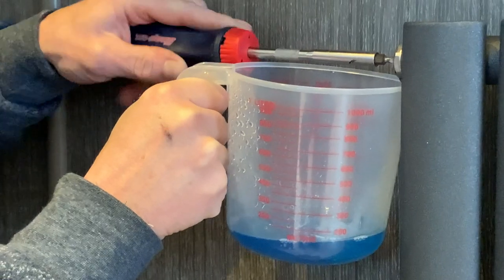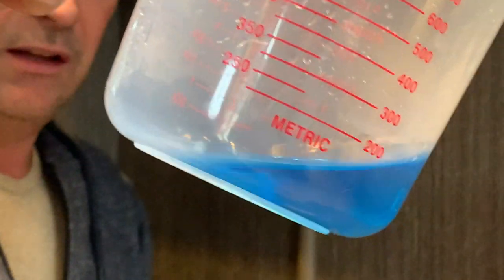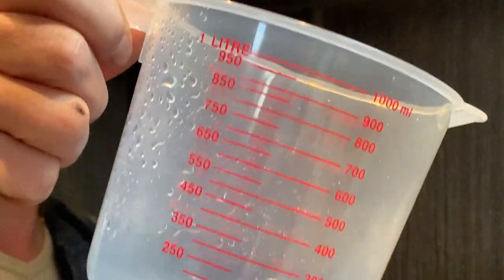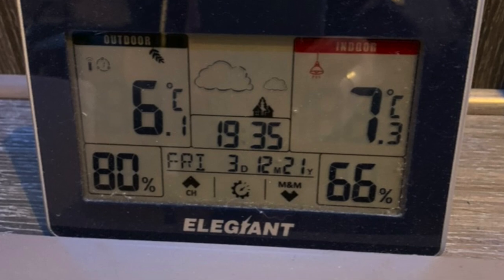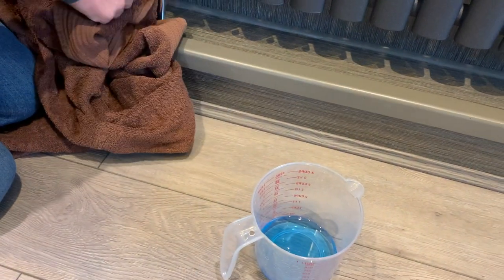I won't drain a lot off because we've already done it. Now you can see it's quite blue. We checked the antifreeze content and it's a lot better — before it was really dark blue, like pure antifreeze, and the radiators weren't getting warm. About 10% of the radiator was hot, the rest was stone cold after running the system for two hours. So it was just too much antifreeze in the system — whoever put it in put too much in, and antifreeze doesn't transfer heat well. It was a little bit chilly to say the least.